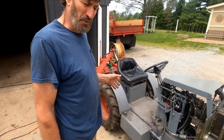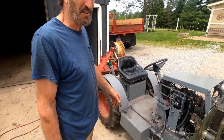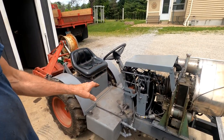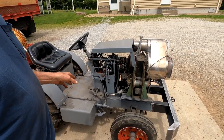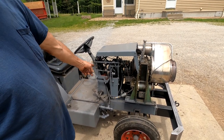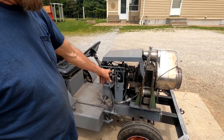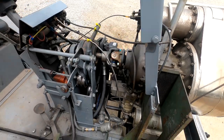And the transmission is a 3-speed transmission. It's a Ford 3-speed out of a pickup truck or a Mustang or something from back in the 60s or 70s. And the drive unit that drives the transmission has a Vickers piston pump, which drives through a chain case, the input shaft to the transmission, and then which drives the pump is a Sundstrand 15 series hydrostatic pump. And that drives off of a PTO shaft here in the back of the engine. I can open up the hood here.